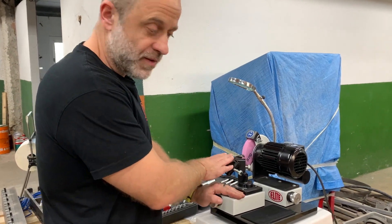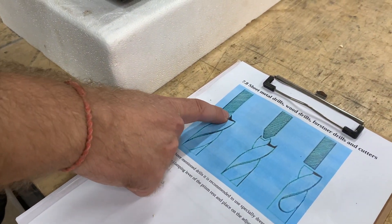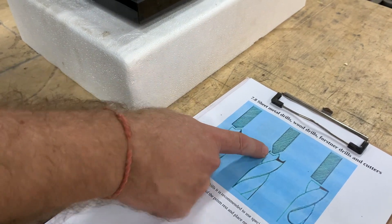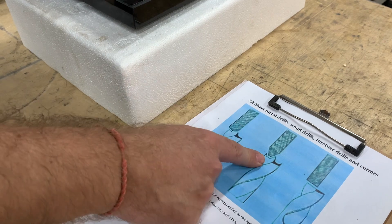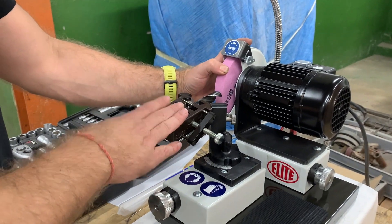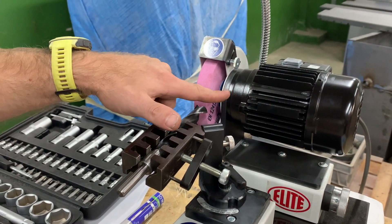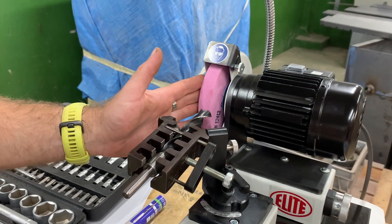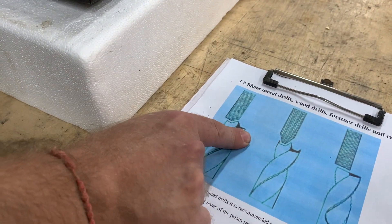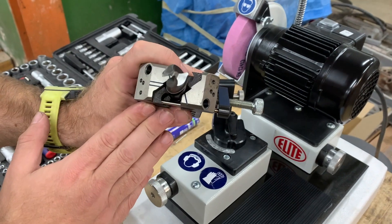In order to grind wood drills such as these, it is also possible to grind a straight drill for metal. It is recommendable to have a grinding wheel with the angle or shape required — a normal grinding wheel or a CBN grinding wheel — but with a small angle or chamfer on this side. We can do it manually on a Corundum grinding wheel or by using a CBN grinding wheel with this small chamfer or angle.